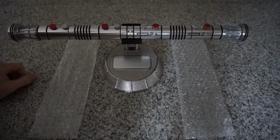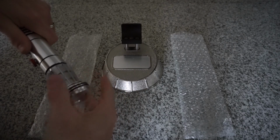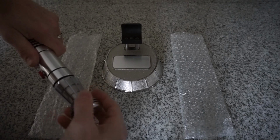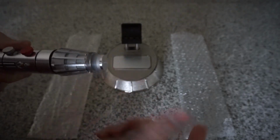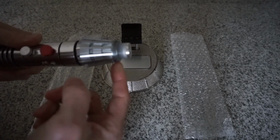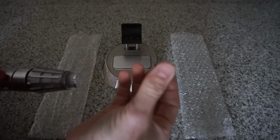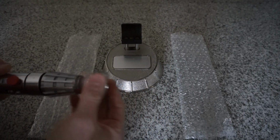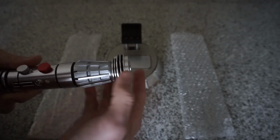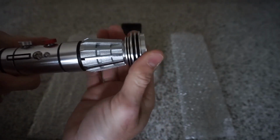And then, of course, to remove the blade plug, you don't need to remove the whole emitter, just the emitter cap. Loosen your retention screws on both sides. Take the plug out. Drop your blade in, 7/8 inch. Screw your retentions back on. And then you can either put the emitter on the blade from the bottom, or after it's on, drop it all the way down. But probably to avoid scratching your blade, I would just slip this on the bottom of the blade, put the blade in, tighten, and then put your emitter cap back on.